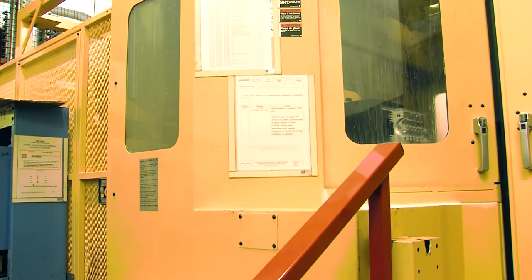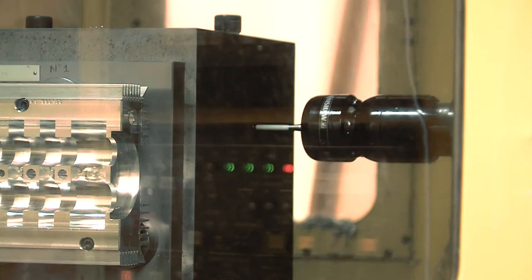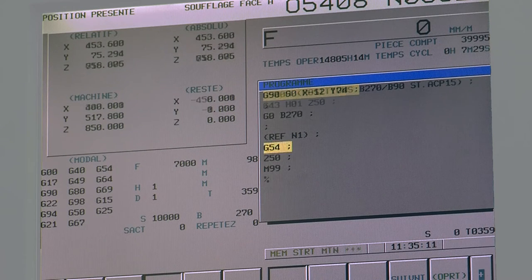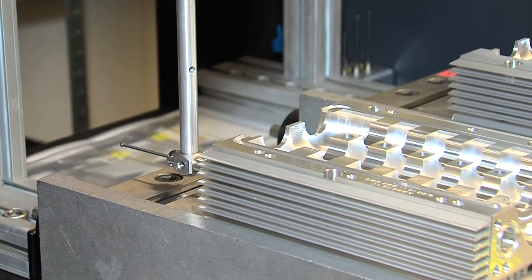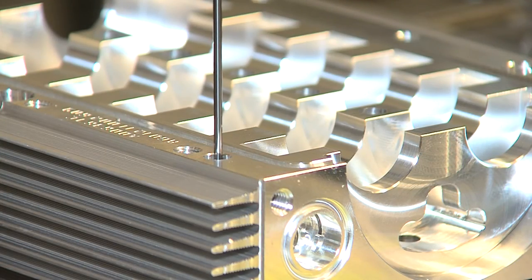Contactless pumps require perfect quality of the parts and low deviation of parts dimensions to manage proper internal clearances inside the pumping module. All critical parts of the ACP are manufactured in high-precision machining centers. These centers are constantly monitored to ensure good quality control and are equipped with dedicated cutting heads. The cutting process conducted by them is constantly optimized.